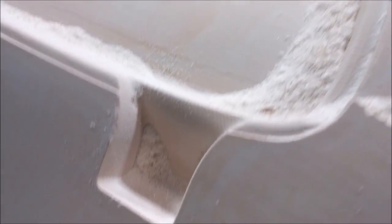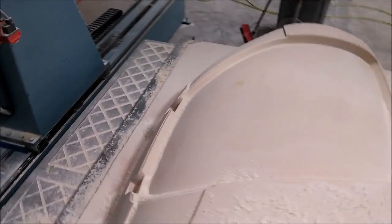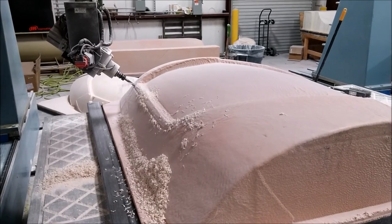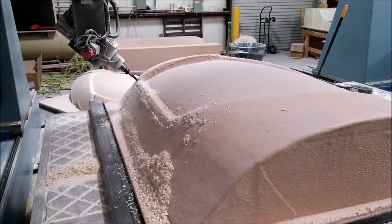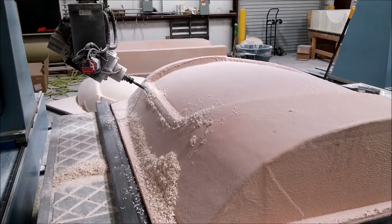That's the finished product. All the milling was done around the flange as well, cleaned up, and the swarf cut done for where the little indent is for where the door mates to this. This will create an insert that bolts into our roof plug or roof mould, allowing us to create the frames at the same time as the roof. Finally, here is the next one — the left-hand outer door frame — all that's left to do, exactly the same as the right-hand one. That's the update for the rest of this week, thanks for watching.